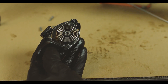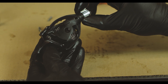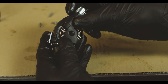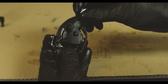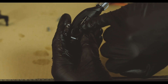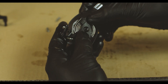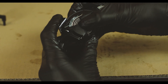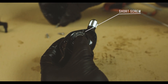That's fairly easy, but there's a trick when you put this internal cover back on. You'll match up the bolt holes, but the spring needs to be pushed out. This outer coil of the spring that goes into that cast notch needs to get bumped out by this little plastic lip here. You can see how this outer coil rides over that edge right there — that's crucial. With this cover in place and the spring dialed, we can flip this thing back over and fire those bolts in from the right side.